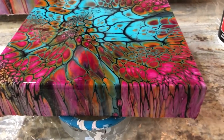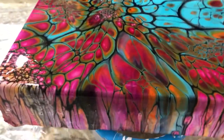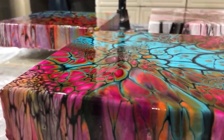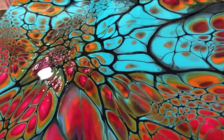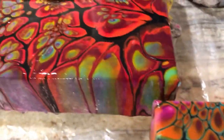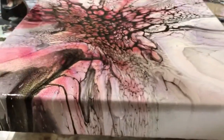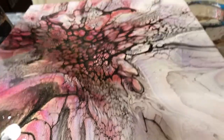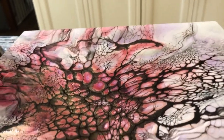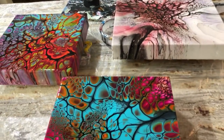Here's the one we just did — this one just received its third coat of Bright Tone High Solids Top Coat Clear Gloss. Looking at it from the side, it's kind of flat — you don't see any streaks, any lines, nothing. It just self-levels like resin in that respect. Same with this one over here — no streaks. The real telltale one is always the first one because that's the one that usually streaks up on me. But you don't see anything at all — kind of amazing. I'm going to let these sit and dry for two hours.